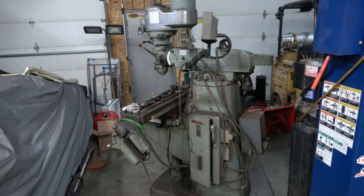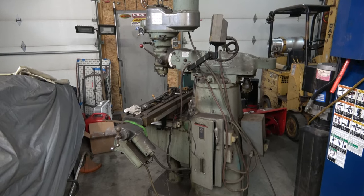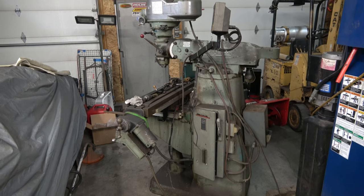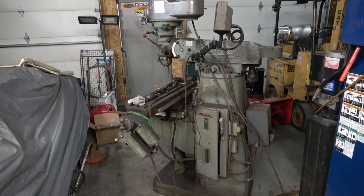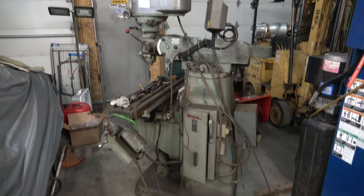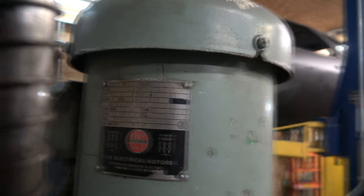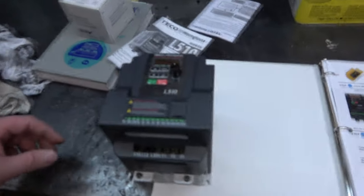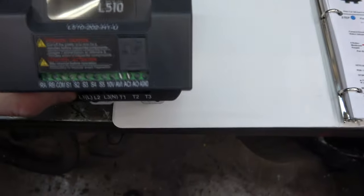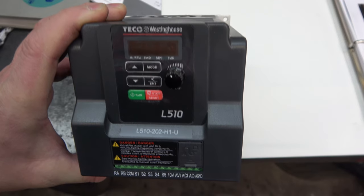What I'm going to do is put an inverter on it. I looked at other stuff like a static phase converter — I heard not-so-good things about those. Rotary phase converters seem like more for multiple pieces of equipment, and I just have one. This is a two-horsepower motor, so I had to get an inverter that's going to be 240 volt single phase, both hot legs.